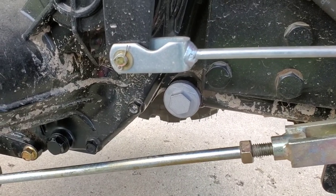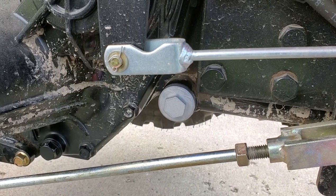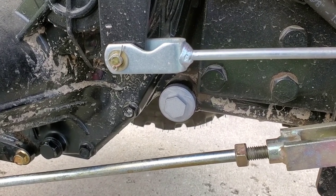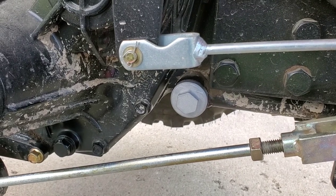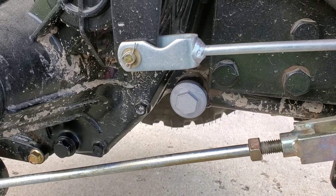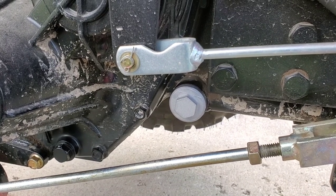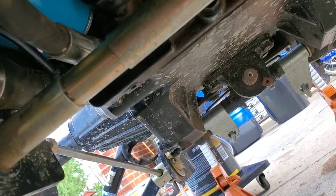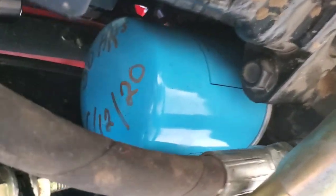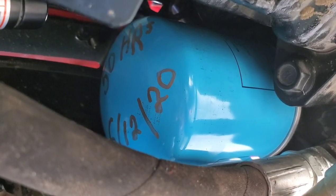We've wiped everything good and clean around here, got all the oils off, and we will pump the hydraulic fluid back into the reservoir last. We're going to go over and I will show you the process for everything that was done underneath yesterday with regards to the hydraulic filter itself as well as the oil filter and the front end lubrication. Now being back underneath the tractor here, you can see tucked away on the front side of the rear transaxle — there is your hydraulic filter itself.